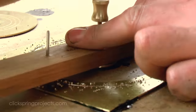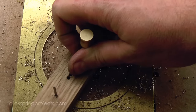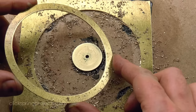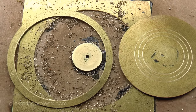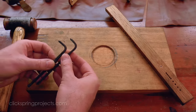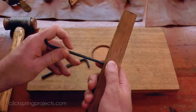In one of the previous videos in this series, describing a scorper and trammel, I showed that the large circular shapes found in the mechanism can be cut with precision using a simple tool, consistent with the metalworking technology of the time. So this leaves only the formation of the small round components, like the arbors, shafts and bearings, to be explained. They're generally fairly short and thin, so we're already talking about a relatively small tool. The size of the parts also means that we can rule out any requirement for a pole-driven mechanism. A hand-operated bow will provide more than enough driving power.